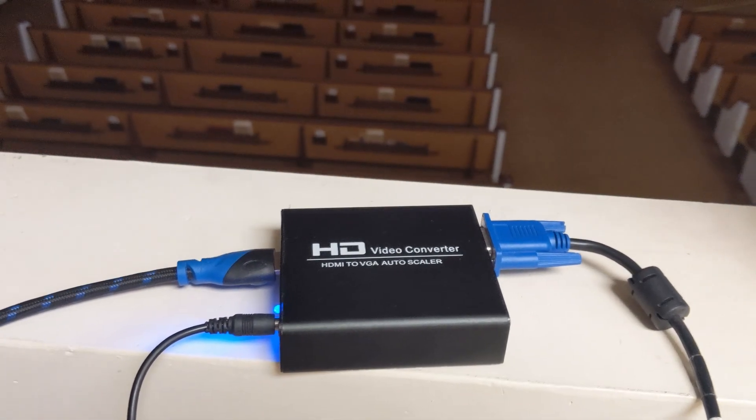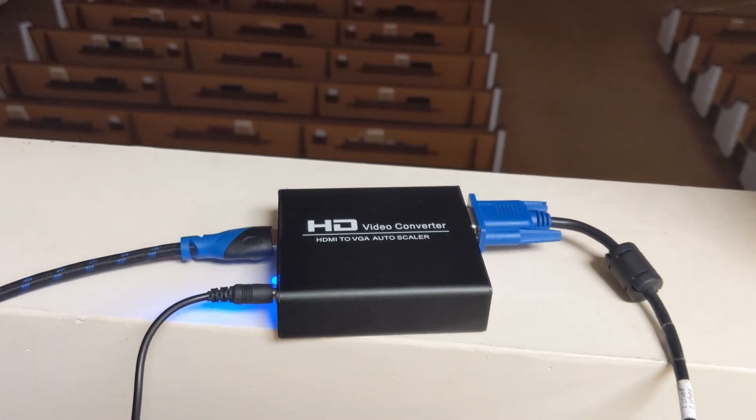I've had to use this box here — an HDMI to VGA scalar — to change the resolution to match what I need for the stuff to work in our projectors. The one problem with that is we shoot in 1080i because we're using the old Blackmagic ATEM switcher, so it doesn't support 1080p. It supports 720p, but even with that setting the projectors still have a problem because of the frame rate. I can actually do 1080p on these projectors, but for whatever reason the projector on the left doesn't like the frame rate that's being pushed out.